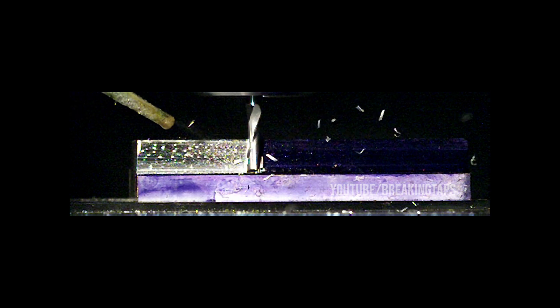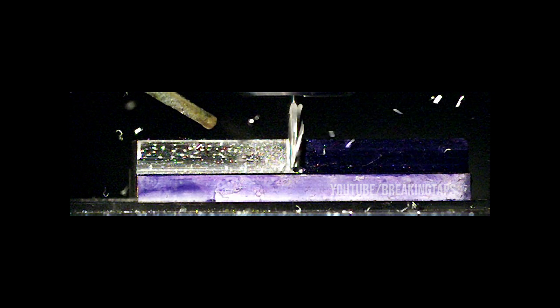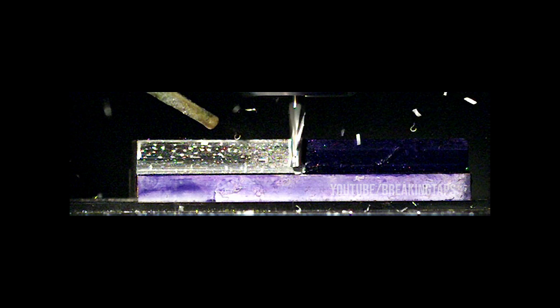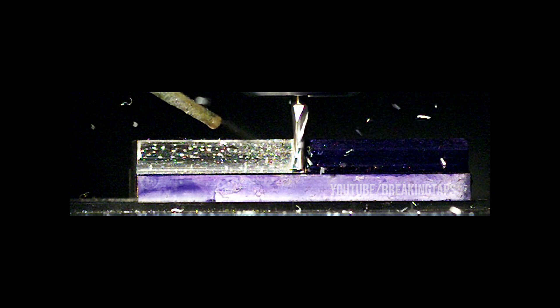Here's an example of a conventional cut. Apologies for the misdirected coolant — it was going a little crazy, so there's more coolant than there should be, which made the chips a little stickier. One interesting thing: because of the angle of the fog buster and the way chips get thrown off this cutter, there is more recutting going on. With the long stringy chips of the single flute, they got carried away pretty much immediately. But here, the little chips towards the bottom of the tool get thrown around the tool more, get caught by the air blast, and get pushed back into the cut — so there's actually some chip recutting on the backside of the tool, which is not what you'd expect from conventional milling. This is mostly an artifact of where the fog buster is, and I thought it was interesting to see.